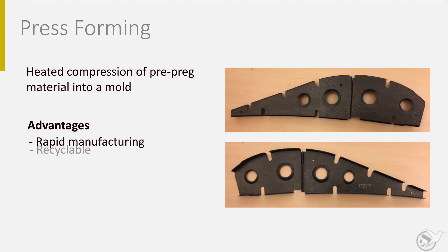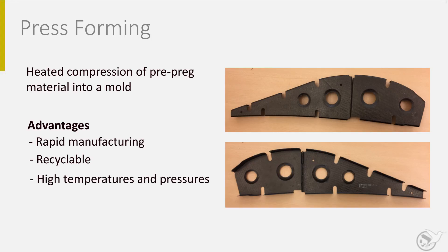During the process, high temperatures and pressures are required. High pressures are needed because the viscosity, even at high temperatures, remains rather high — putty-like. The ability of repetitive heating and cooling also allows thermal welding. If two thermoplastic composite parts are joined together, local heating, pressurization, and cooling down can create a local bond, when the thermoplastic resin of both parts fuse together locally.